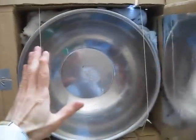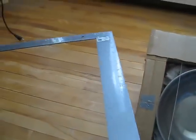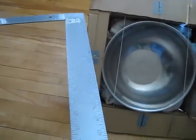It turned out the sunlight wasn't being reflected where I thought — it was actually over here. The way I found that out was by using a more precise technique. I took a square, which is a carpentry tool — you can use anything with two edges at right angles to each other. I put one edge of the square flat against the solar cooker, took the other edge, and lined it up with the top of the reflector. Then I looked at the distance that the square overlapped the solar cooker — here it extends out by about one inch.